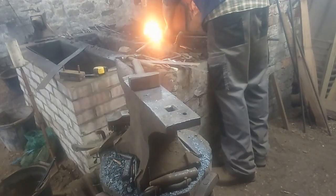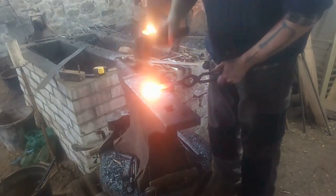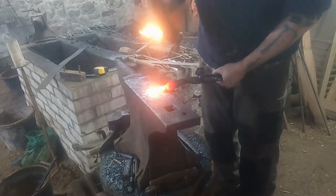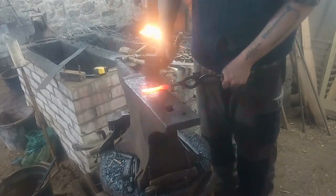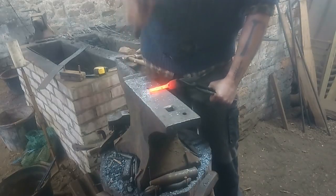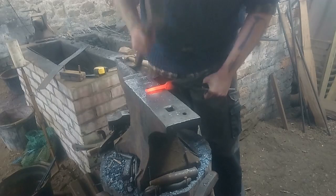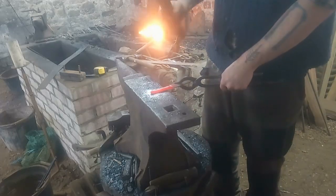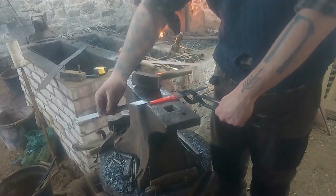When forging historic blades, I've found that using reproduced tools works very well. The tongs I'm holding this with are actually an iron pair of tongs reproduced from a grave find at Danebury Hillfort. I also have an iron hammer I forged, copied from Danebury, with a similar example from Fiskerton Causeway. I find these work perfectly for making all Iron Age equipment — even working on a small tent-style anvil modelled on Iron Age examples rather than a London pattern anvil. I've even forged a sword on an anvil no more than two inches square and found it easier than on a larger anvil.